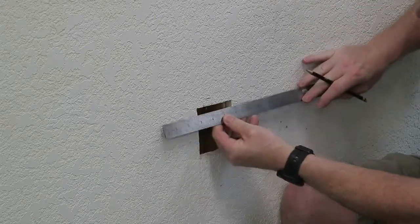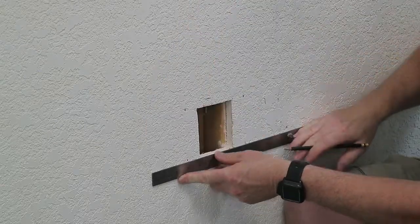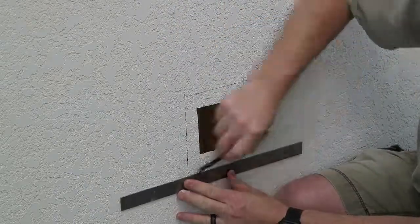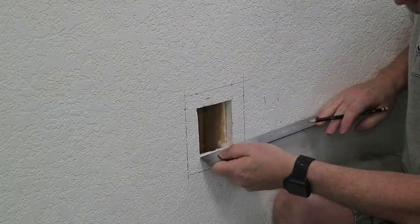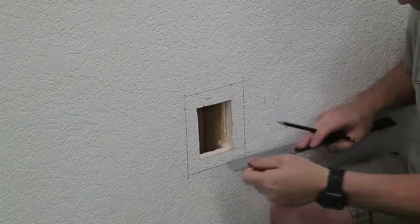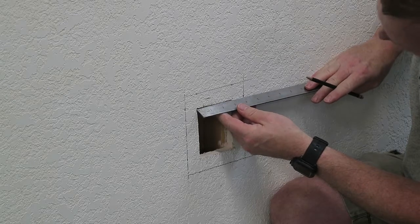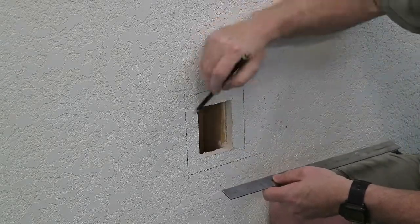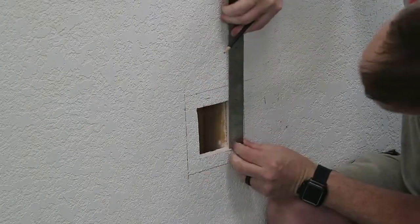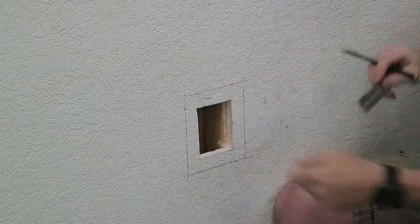The first thing we're going to do is add an inch all the way around our hole. This doesn't have to be exact. Let's take a measurement on the hole itself - you've got to make your piece just a smidge smaller than the hole. My hole looks like it's two and seven-eighths at the bottom and about three at the top, so we'll go with two and seven-eighths for the width. Then from the other direction it looks like three and three-quarters. So we'll do two and seven-eighths by three and three-quarters.